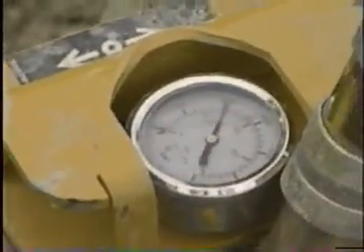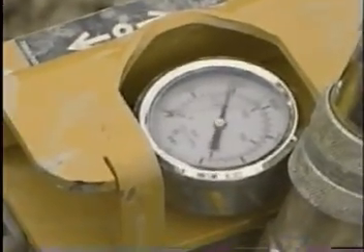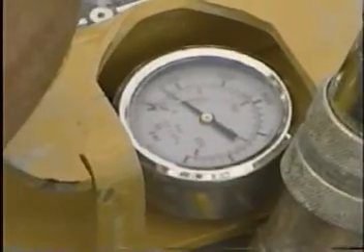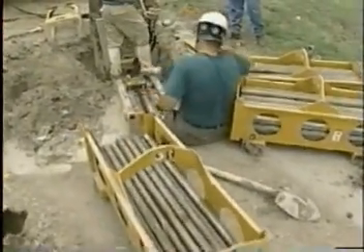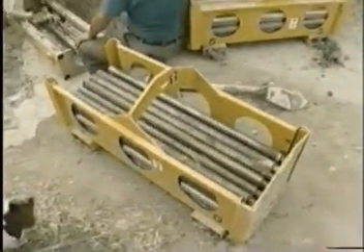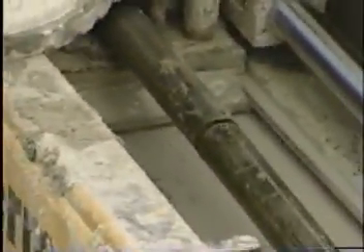You can see by the pressure gauge that we're actually pulling back about 12,000 pounds, which isn't too bad for a six-inch pullback. There's plenty of pull still left in the machine. Once we've paid the rods back, they get stacked away into their own box cradles, which again makes it easy for delivery to and from the site. Once the rods are in, we slide a gate down in front of them to stop the rods from paying out, then we load them onto the truck and basically the rods are done.